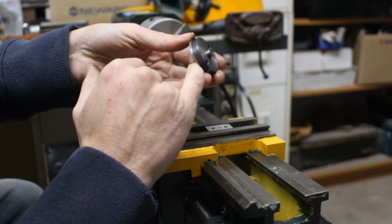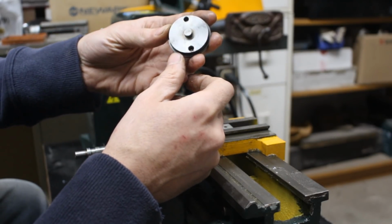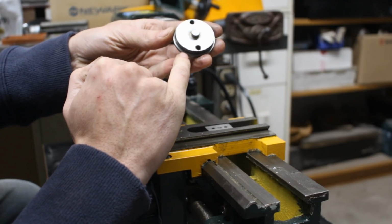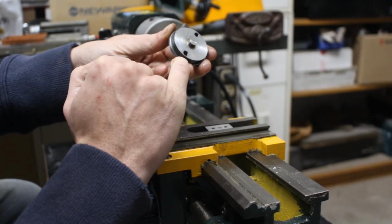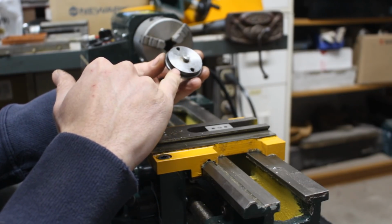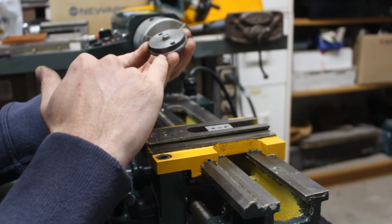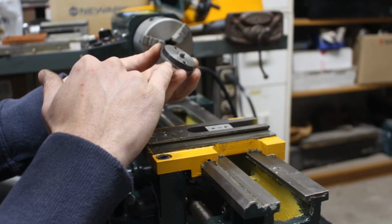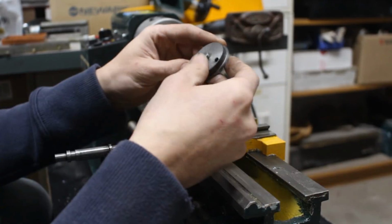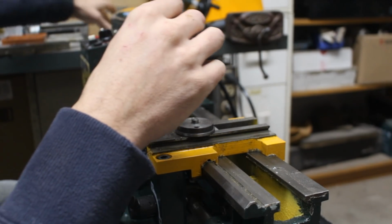So, for some reason, this flange is a little bit too low. So, we need to change the distance between the flange and the top end of this plate by at least 10 tenths. Or, we need a 10 tenths shim here on this flange. Maybe that's a way to do it. Maybe we can make a shim for here. But this means taking measurements now, then assembling the lathe, producing the shim out of something, I don't know what, and then disassembling it again. Maybe that's what we should do. I just wonder, was that a factory error, or how did it happen?